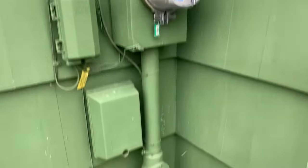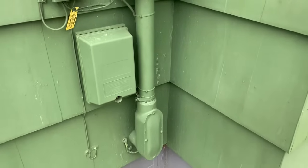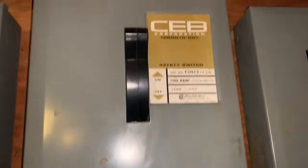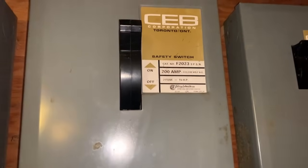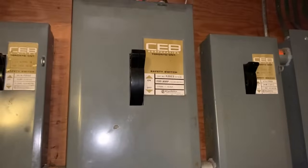Here's another example where the pipe comes out of the bottom — also two inches — but it's a little trickier where it comes in downstairs. You can see the inside of this pipe where it comes through, just like I showed you outside, and it's clearly marked 200 amp. What they have here is 200 amps coming in, and then it splits to two 100 amp disconnects. Traditionally in the 70s when they wired these homes, they went to two separate 100 amp panels, but that still means the main service coming in is 200 amps. It's important to look at that main coming in, not the sub-panels when they're broken up like this.